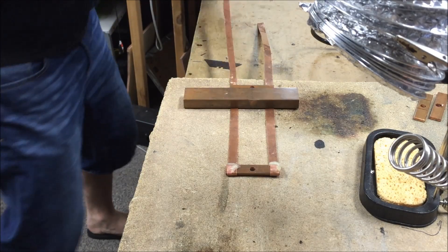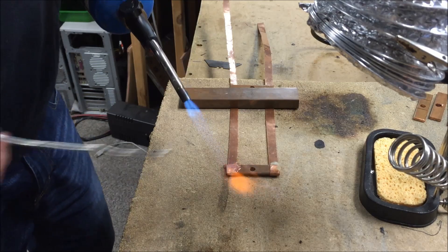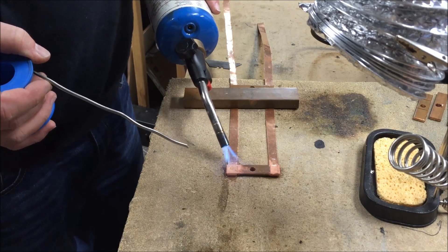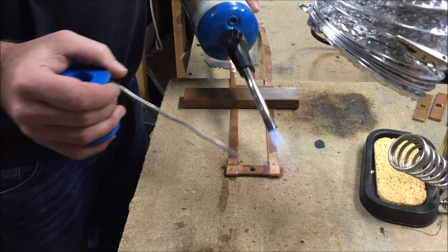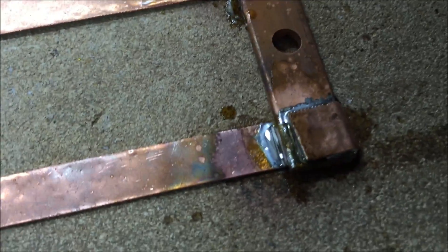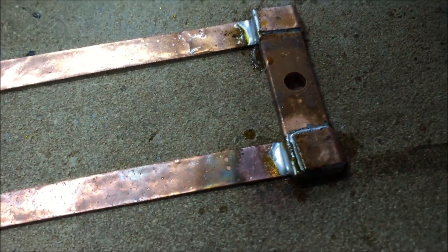Last time I was heating this all the way up. This time I just get it warm, and I heat the solder up a little bit too, which helps. I was waiting for it to go green and discolour before, but I found that didn't really work for me. Now basically all I'm doing is putting the solder here — it's hot so I'm not touching it — and it's actually wicking all the way across the top.